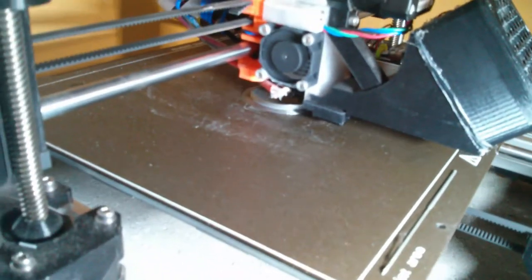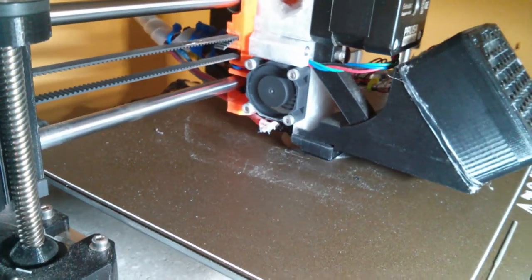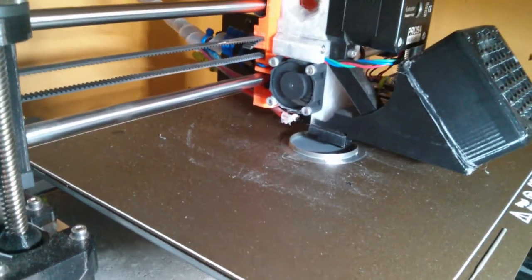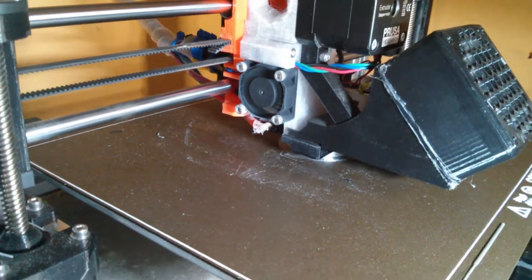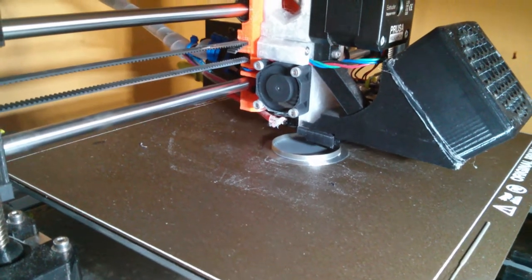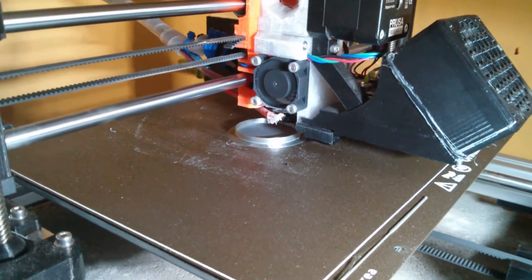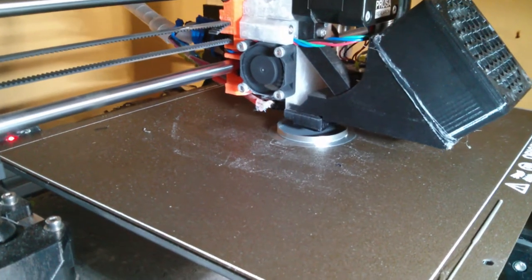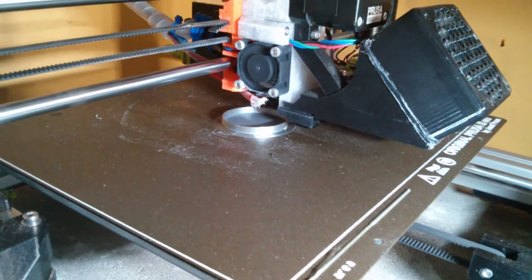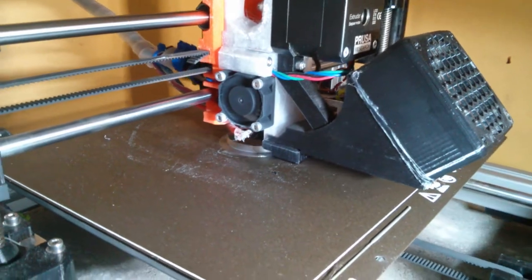Thanks everybody for your help. It's printing the cylinder now — every 10 millimeters it will go down in 2-degree increments, starting at 210°C. It won't do the first increment until it's at 20 millimeters high, since I didn't want to mess with the first few millimeters. The temperature has stabilized at 210 and it will go down all the way to 196°C. I expect it to cut off before it actually gets all the way up to 100 millimeters tall.